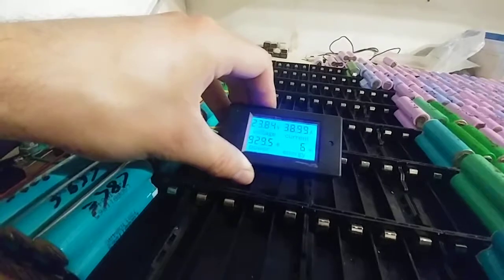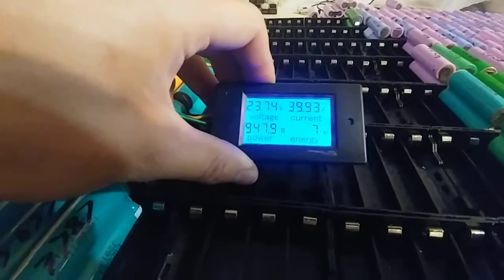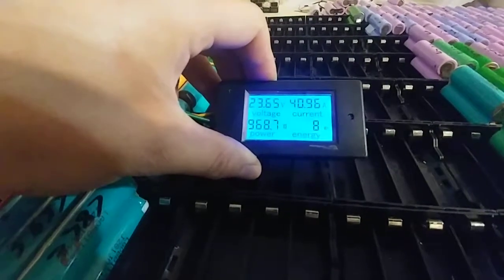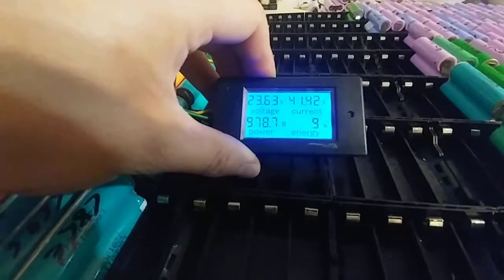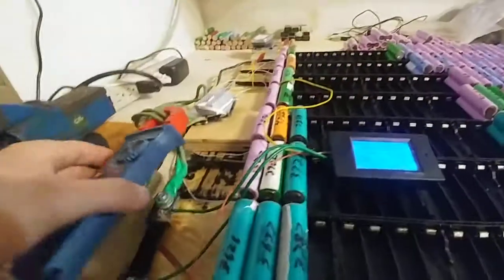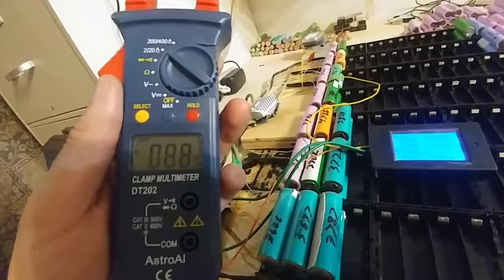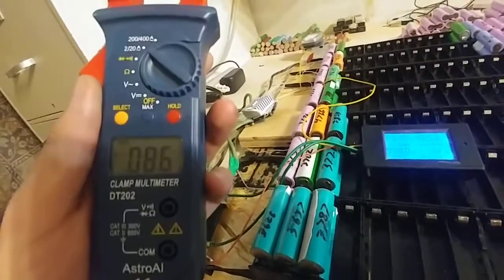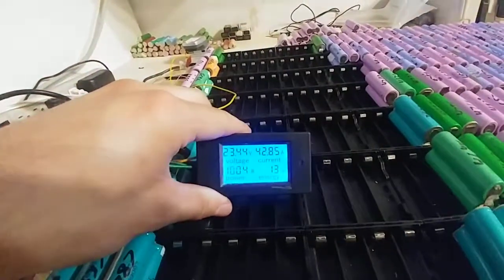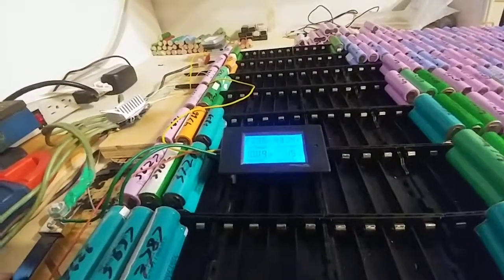5 watt hours, over 900 watts, pulling it right down to 23 volts — wow, 41 amps! I knew this wasn't reading right. That's because the old meter reads AC current, not DC — that's why you need a shunt. Look at this: 42 amps, no wonder it's getting warm. Well, it takes a while to get warm, but yeah.